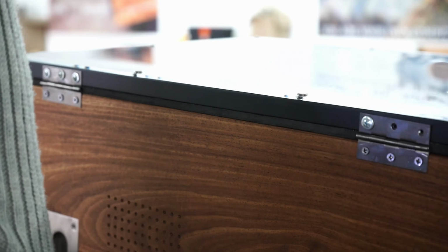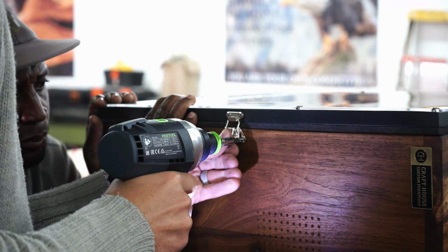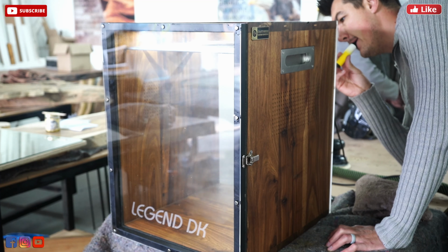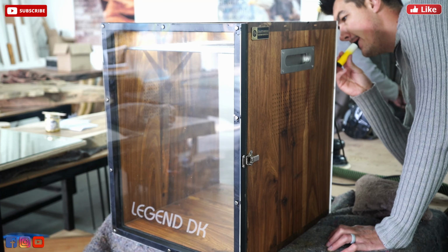And on the side of our unit, we added a small little clip to make sure you can manually clip and unclip, seal the box, so the front door is going to stay closed. Now just testing the box by adding some smoke inside to see if there's any leakage in front of the door. And I honestly do have to say there was some minor smoke coming out the front door, but the main air came out from the sides, the small little holes we drilled.